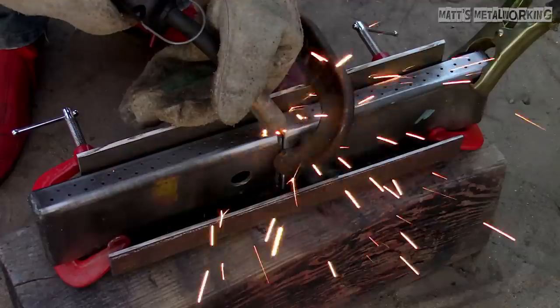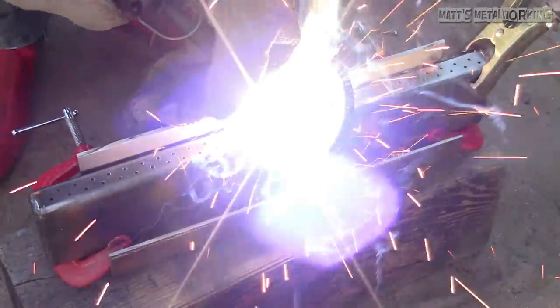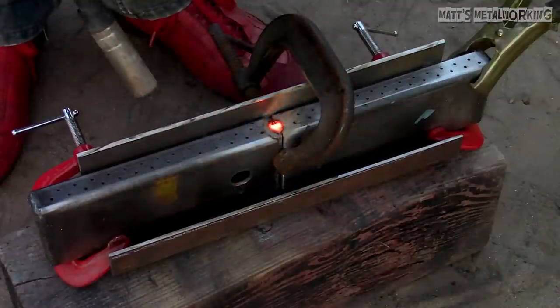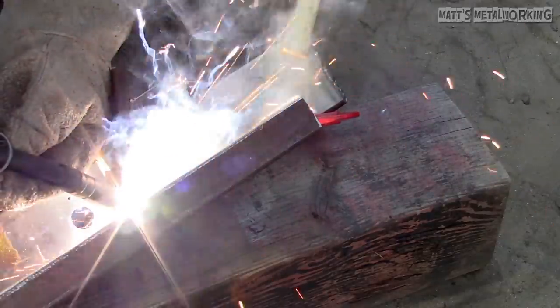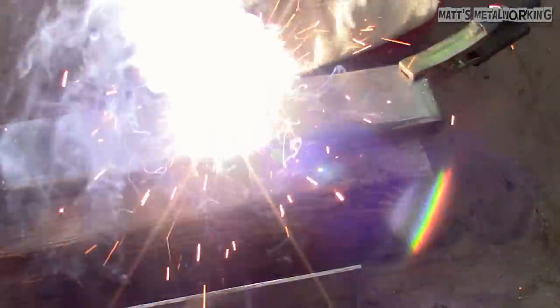Connect the two burners together. I had a scrap piece of tubing with one side missing, which makes it a great jig to keep the burner square. The center divider was inserted in one piece just like the end caps. Once clamped into place, tack welds will be needed to keep everything together until beads are ready to be laid.